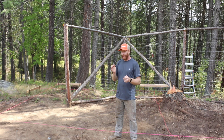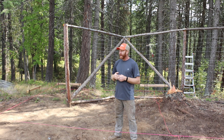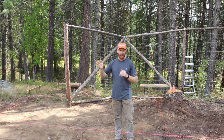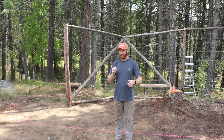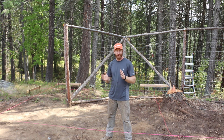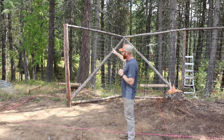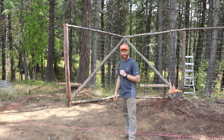So that will be a 2x6 perimeter board all the way around. And then I've got a bunch of leftover steel studs from a job probably a year or 2 ago that we're going to use as our main joists down the center. That'll help with dry rot, insects, things like that. It's a good way to use up steel studs when they're a structural grade stud. They're strong enough to support the floor. So I'll start by taking this down, and when Sarah's out here, we will start squaring this up.